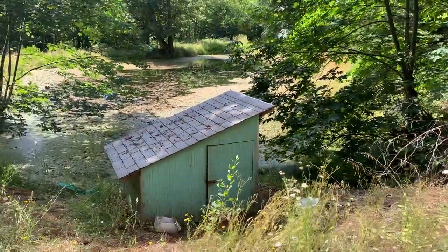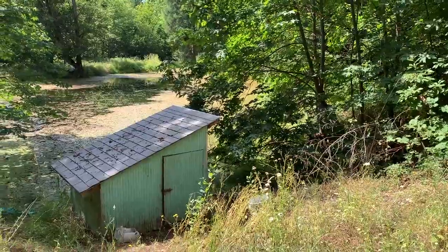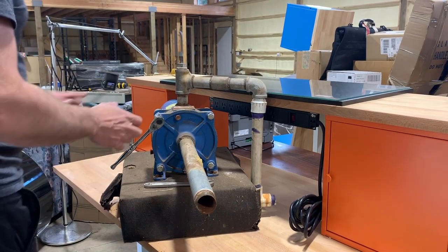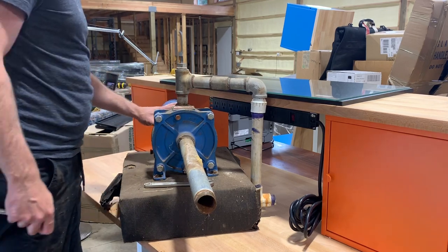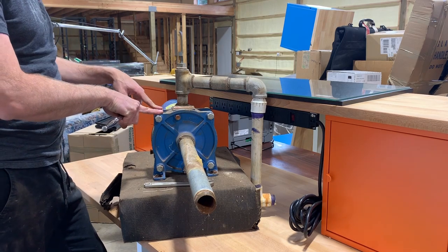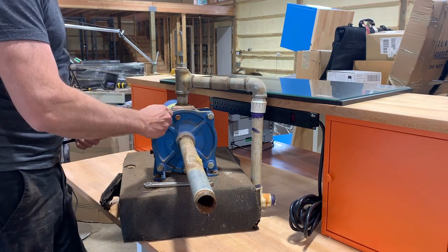The verdict is that the pump is not creating suction, so we're going to replace it. I might go take the old pump down to the shop, take it apart and see if we can work out what actually caused it to fail. So I extracted the old broken motor and pump. The motor itself is fine, it's 1.5 horsepower, 240 volts. I'll probably keep that for useful stuff around the shop. We replaced the pump and motor with a new motor and a double impeller section pump, so a two-stage pump that gets us up to the 90 psi.